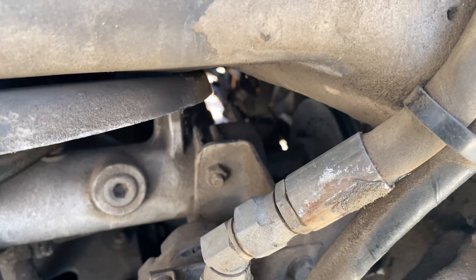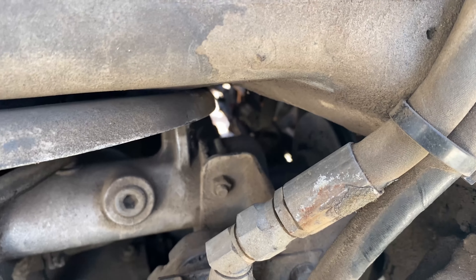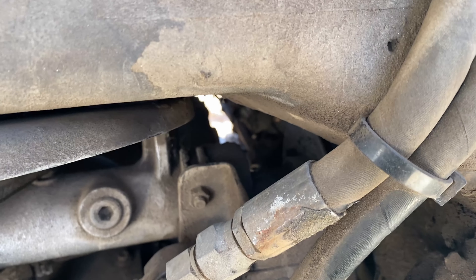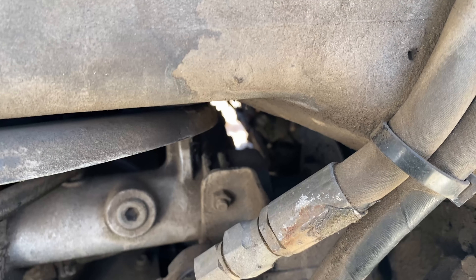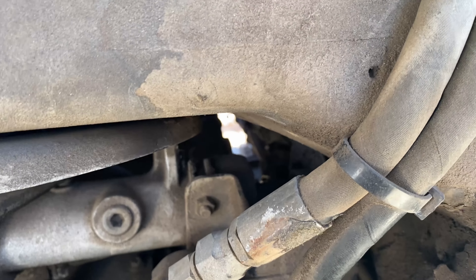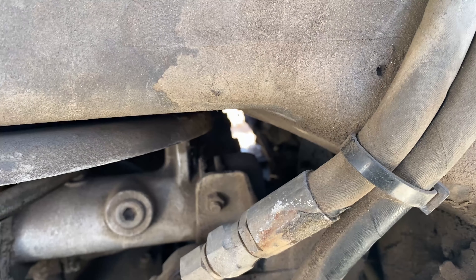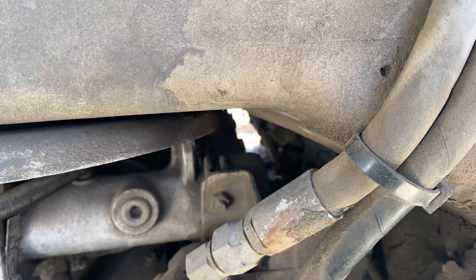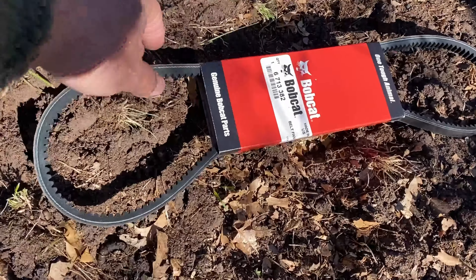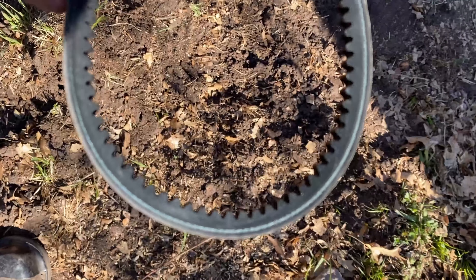What's the best way to replace that belt? Like with anything you do on a Bobcat — any way you possibly can, because you can't reach anything. So we're going to try it from this side and from the door side as well. They tell me removing the battery is a good idea. I'm going to try laying something over the battery so I don't get acid on me and try to work around it, because removing the battery on this machine is kind of a pain too. Here's the new belt we picked up.